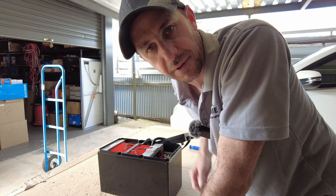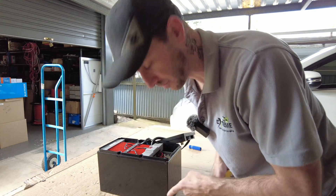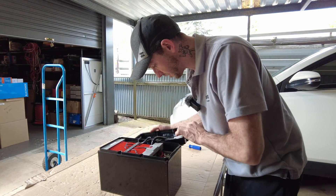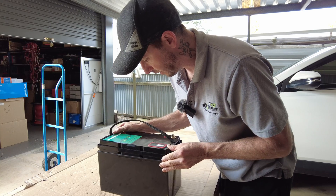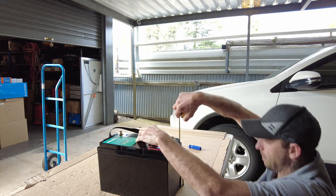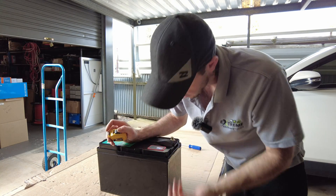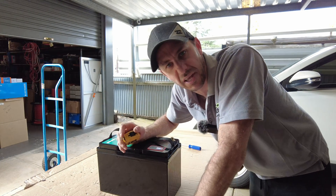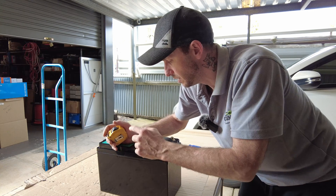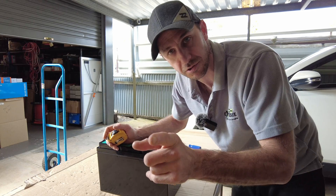The case size - they're not overly big either guys. Let's grab a tape measure: it's 170mm wide, 325mm long. This will fit in your little chassis-mounted boxes on the side of your caravan. Height to the terminal bolt is 230mm. This is comparable to most of your 120 amp hour AGM batteries on your chassis mount on your caravan.